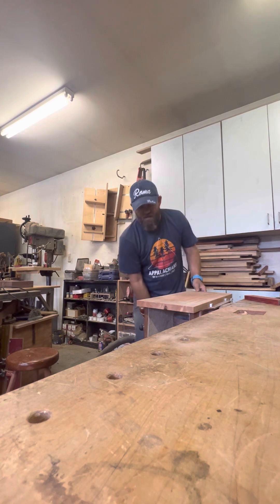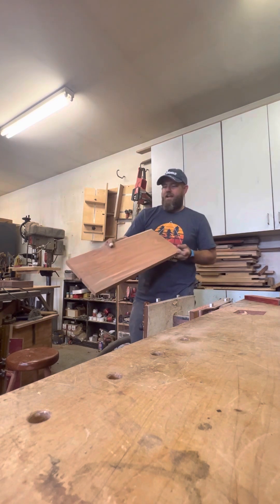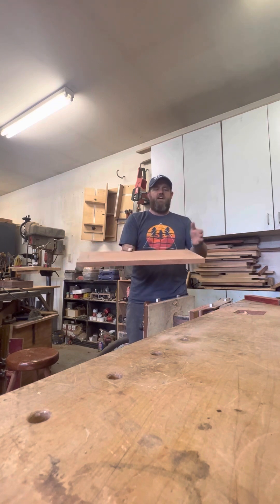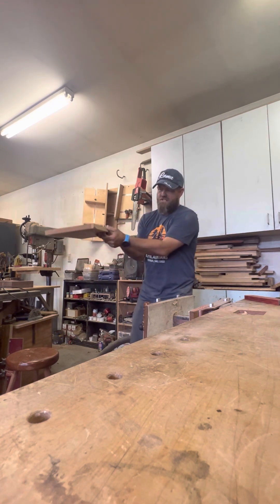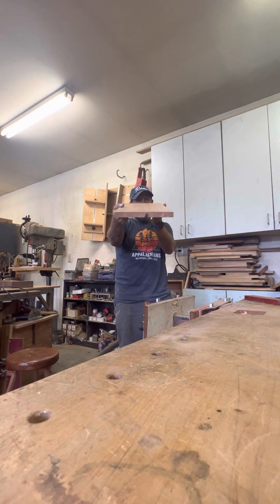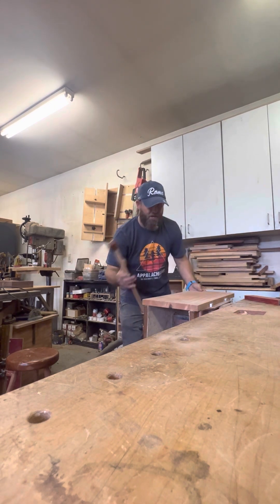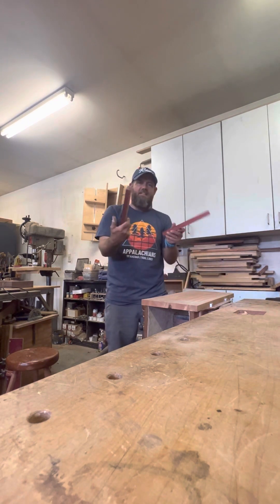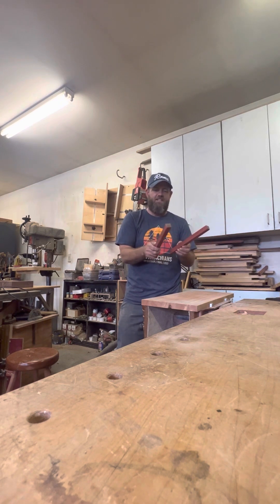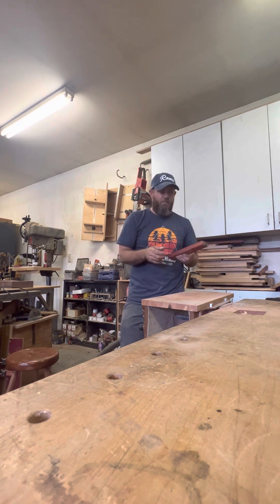I took this piece down — this is a beautiful piece of cedar, and it's for a 16-inch telescope. It's cut just a little bit long, a little bit wide, and a little bit thick. I'm letting the wood do what it wants to do. Looking at it, that looks almost dead flat already, which makes me very happy. The less it moves, the easier my job is. I make winding sticks — usually a pair — every three to four weeks. I never finish them because I make them dead flat and parallel the day I do it; it just takes a couple of minutes.